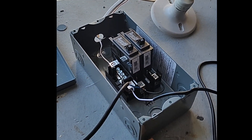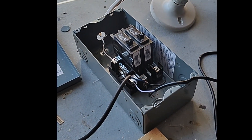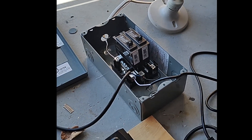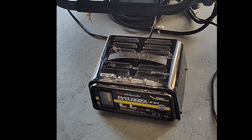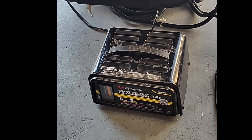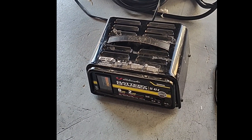When the generator is running, it's providing power to the circuit breaker box. But the inverter stays on the whole time, so the inverter is also providing power to the circuit breaker box — the generator is supplementing that power. Also, when the generator is running, you're going to want to have a battery charger plugged into it. You want a battery charger that doesn't need to be turned on — it just gets activated as soon as you plug it in. Some battery chargers require a button push and we don't want that.